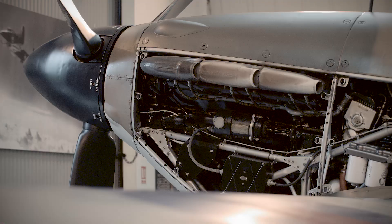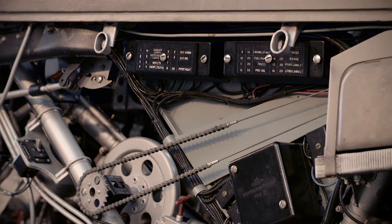A lot of aircraft would obviously come back with a bit of battle damage — a few holes here and there. In something like the Hurricane, you can take the side panels off, have a quick look inside. A bit of hole in the fabric, nothing's been touched — none of the control runs, none of the metal structure. Great, stick a patch on it. That's it, it's good to go.